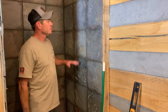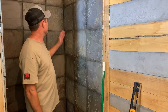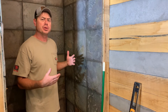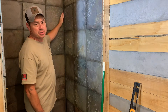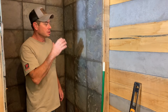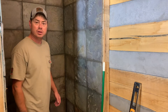So I was using that caulking gun and my makeshift caulking tube with this grout and it was working really well. I ended up stopping using it just because I mixed up enough grout to do the entire shower, so it was taking me a little bit longer doing it that way, having to fill and refill that tube. I did this whole wall with it, and then I switched over to just using it in the corners where it's a little harder to get the grout into, and then went back to the traditional way — just because timing-wise I didn't want to waste grout or let it set up on me.